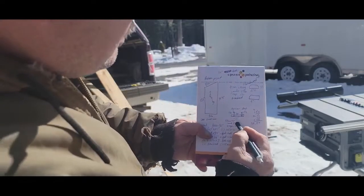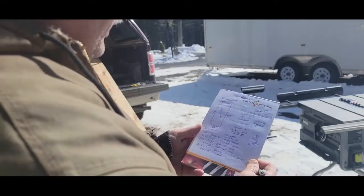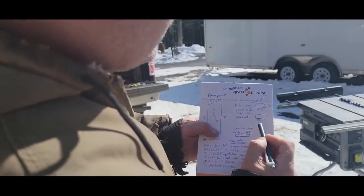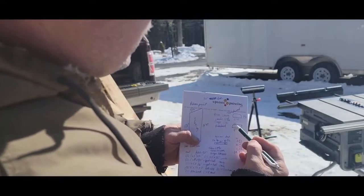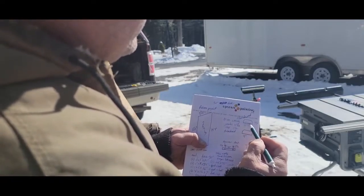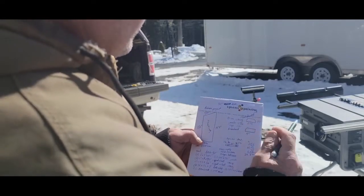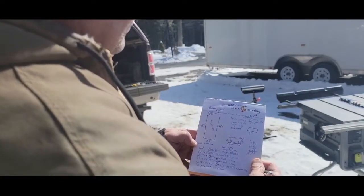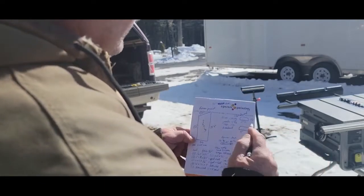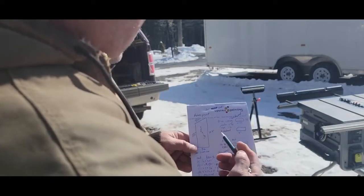It'll look like this. And then this is my rough dimensions here. My baseboard has to be 4 inches exact. It's got to have a chamfer off one edge. The casing needs to be 2.5, and then they have to be chamfered on both sides and then mitered at the top. And then what I want to do is overcut these. I'd like to cut the exact width, but the lengths longer.